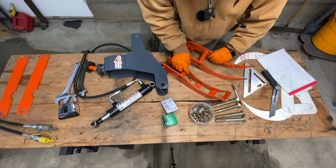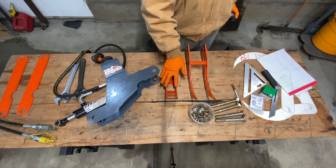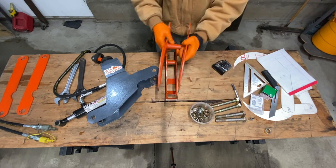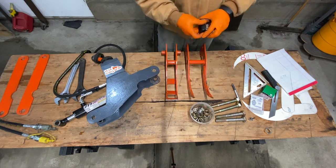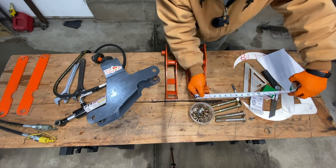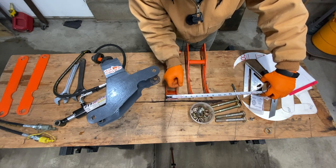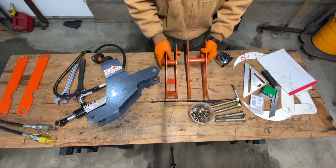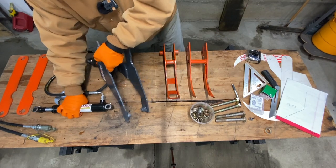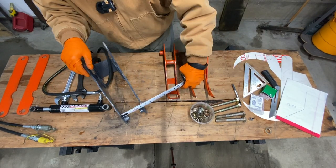On these, you can see that I have one smaller than the other so that it can go in between. When you close it up, it'll overlap like that. This dimension from tip to tip on the inside is 3 1⁄4, and on the outside is 2 1⁄4 — that way they won't interfere and hit each other when the jaws close. The spacing between here is 4 1⁄8.